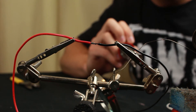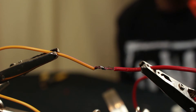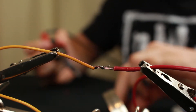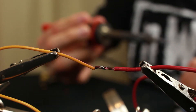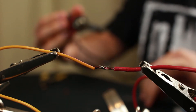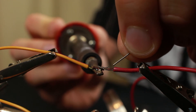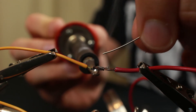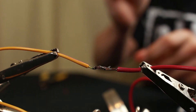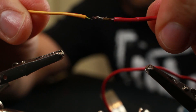Now that's one way to do it. I'm going to show you a better way. Here's another example, more close up. You'll notice that I've twisted one of the wires around the other wire — this will form a tighter joint as they're strongly linked together. And you'll see the solder just flows right in. Pull the soldering iron away and we have a much tighter joint.